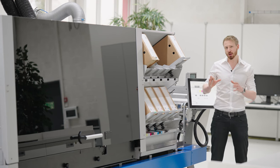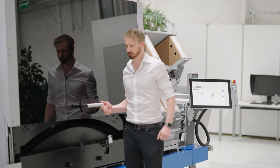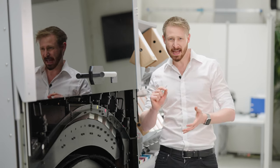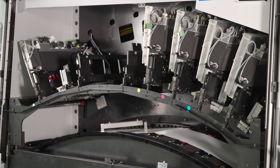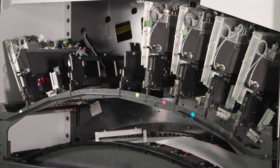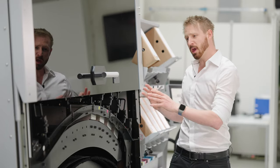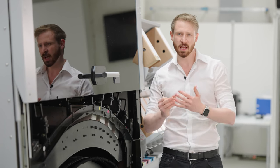Let us now take a deeper look inside the engine. Now we have our digital print unit open. The whole construction is fully focused on reliability and availability. For that we changed the positioning of the print head to a fixed position, which means the amplifier boards and the total ink supply are now fixed in the same position every time. This is a patented system. We now move the web away from the print head, and also bring the cleaning system to the print head. That brings a lot of robustness and stability. In the unit we also have pinning modules to generate an awesome print quality, preventing inter-color bleeding and ensuring sharp edges.